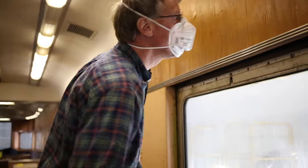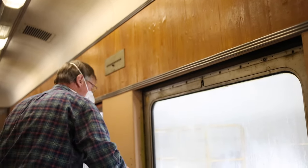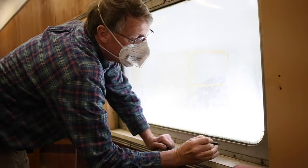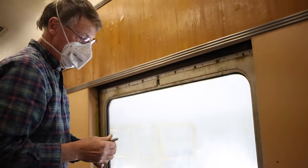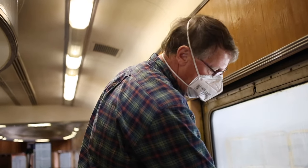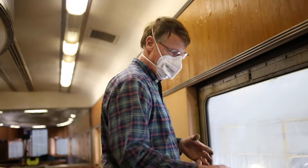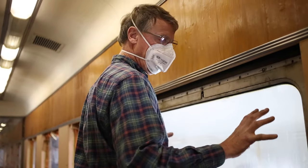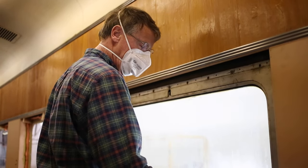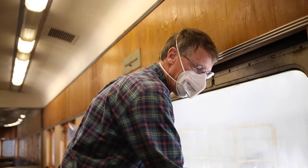But now, when we open this up, we find that there's only 1, 2, 3, 4, 5, 6, 7. 7 of the 40 machine screws. And so that could have also been the problem, as with the sandwiching of this against the frame. If you don't have an even pressure against that, that could also perhaps allow moisture to get in between the gasket and the body frame, and thus allowing water into the unit. We don't know that, but it's just a sneaking suspicion.